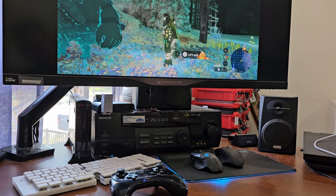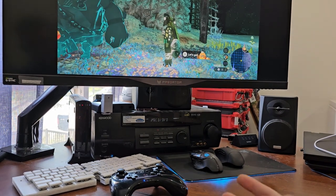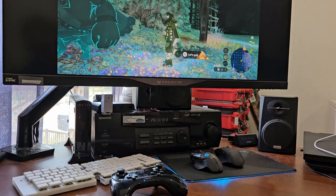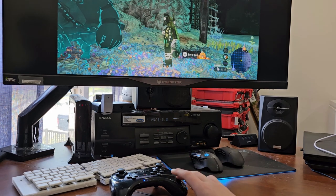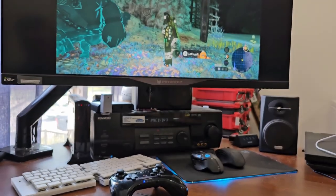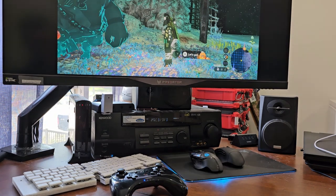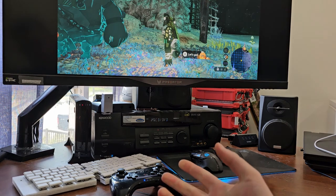In the last clip I said I didn't have rumble working yet, but I actually got that working now. I figured I'd do a demo showing it off, but first I wanted to talk about the issue. I wanted to use the original motor from the Wii U Pro Controller — I prefer the DC rumble, the heavy rumble like on the GameCube and Wii U Pro Controller. I think the issue was they use almost two different formats to drive the rumble: the Wii U controller would just use a straight DC signal, while I believe the 8BitDo uses PWM to run the motor. I was trying to run the DC off the PWM, so I don't think it worked. I don't have an oscilloscope to actually debug that, so anything I do has to be an assumption — but it seems my assumption was right.